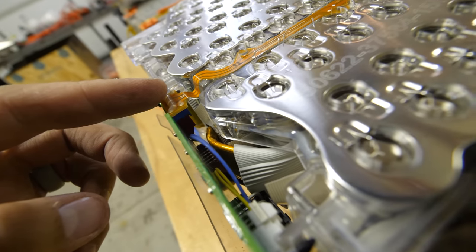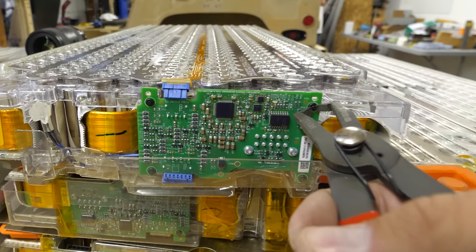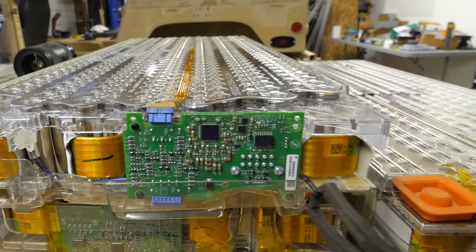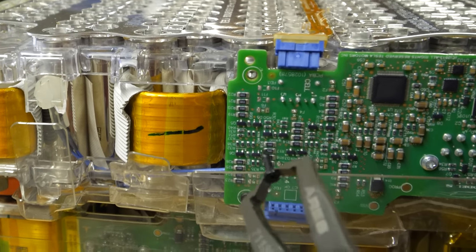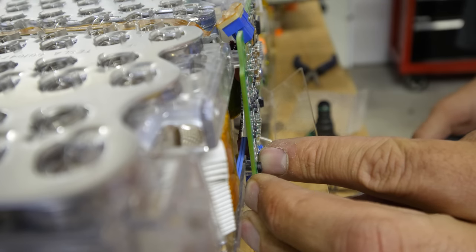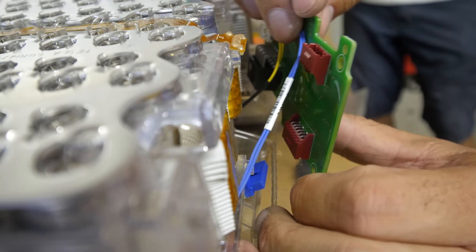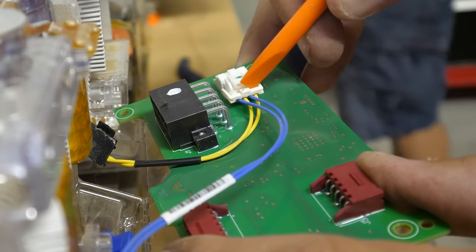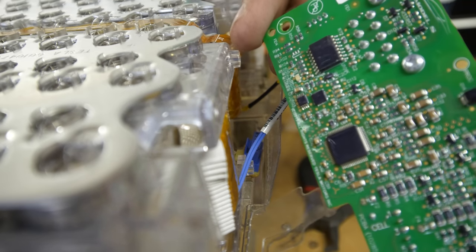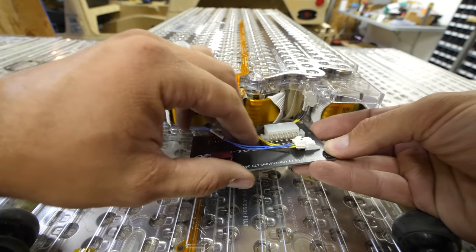And again, we repeat the same thing with this blue and red connector here. There's probably multiple good ways of doing this, but once I've removed the top plug and bottom plug, the cell taps, then I can remove the center black pin from each of the four corner posts. After the center pin's removed, I can remove the post itself, and on the last post, make sure to hold the board so it doesn't get yanked away from the battery. All we have left is the thermistor connection, which has a funny little white bracket that slides out, a latch lifts up, and then the plug is released, freeing Tesla's complex battery board that we can't use, so we can install the more simple BMS board that we can utilize.